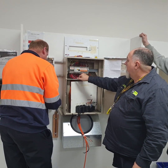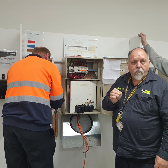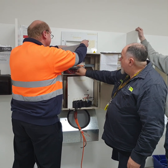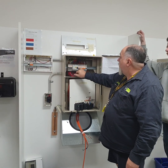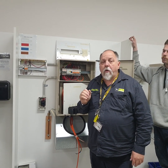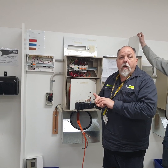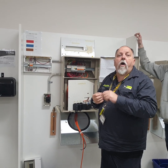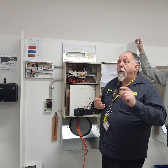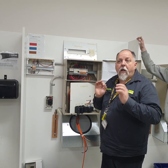The only thing that the assignment didn't say is how the cables are run. The one where we had a bit of a discrepancy, which we won't have with Steve, because it didn't say how it was run, was, for example, the stove up the top here. We looked at it as 2.5. But if it was partially surrounded, and that was told to us in the description, the 2.5 wouldn't pass. We looked up the 3008 book, table 10, and it said a 2.5 is adequate for a stove of 9 kilowatt with 25 amps. If we went to partially surrounded, the cable failed and we needed to put in a 4 mil. They didn't have that in the description.